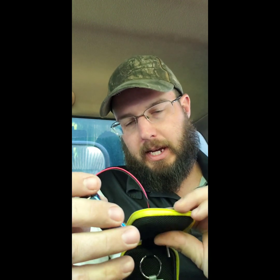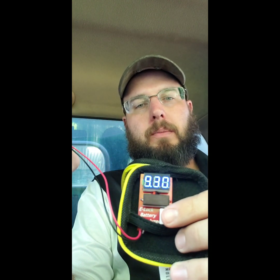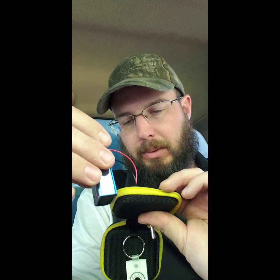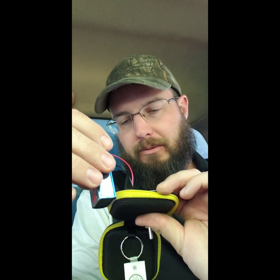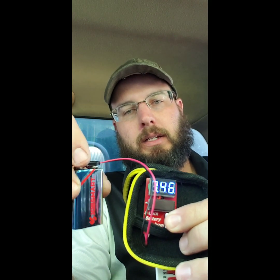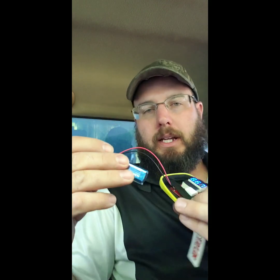These are junk-o-matic batteries from the regular store, just new batteries branded under different labels. Right there we got 9.32 when we first took it up — push the button, give it a load, and we are at 7.6, 7.5, 7.50. So this battery, even though it's not a name-brand Duracell or Energizer battery, this would be a good battery to put into your lock.